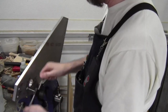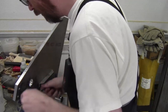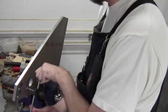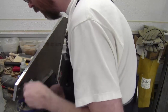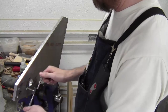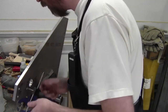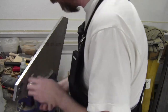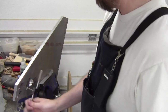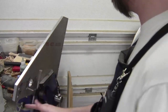It's poking out the other end. And since these are through holes, it's a little easier to work with the chips. Yeah, this is doing fine. All right. So maybe for this small one, the anchor lube might be the way to go. Yeah, that's working out well. Okay. So I'm going to go ahead and get these guys tapped for 10-32.